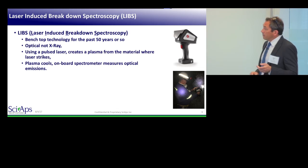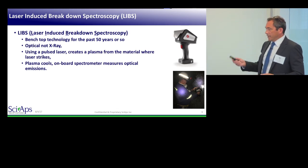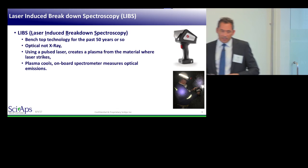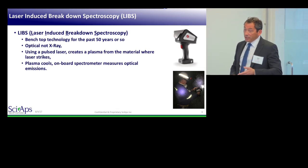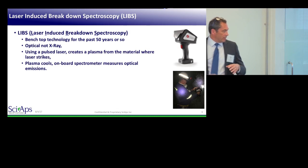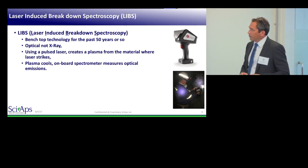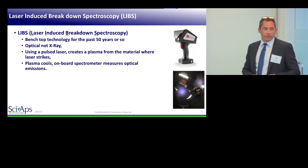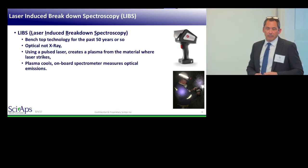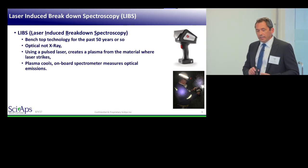The way LIBS works: it fires a pulsed laser at the rock — the laser is roughly a hundred microns in diameter — which vaporizes some of that material into a plasma. As that plasma cools, it gives off optical light which we measure. Each element has certain optical emissions, so by measuring how much light at a certain wavelength you can deduce what elements are present and at what concentrations. To jump to your question about rate of adoption: it is very much true that the mining and oil and gas industries tend to be conservative, and with limited capital budgets it's very hard to justify taking a chance on a new technology.